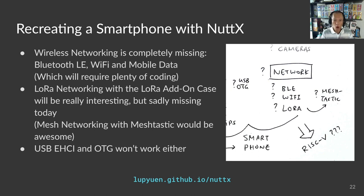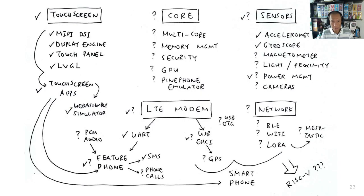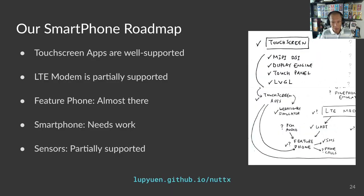A modern smartphone has so many things inside. How close are we to getting everything to work with NuttX? This is our roadmap for NuttX on PinePhone: the features we have built, the features we are going to build, and the features we built halfway through. The touchscreen works great, even with touchscreen apps. Our support for PinePhone sensors is a little spotty, and we have some glaring gaps — USB, networking, call security features — because we are a very tiny team building NuttX on PinePhone.